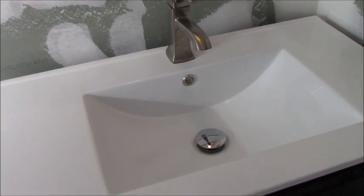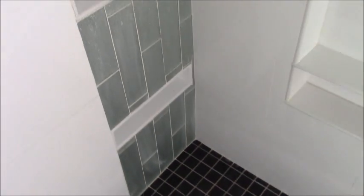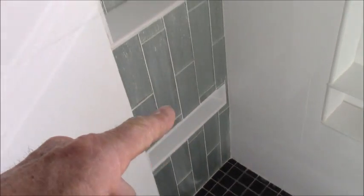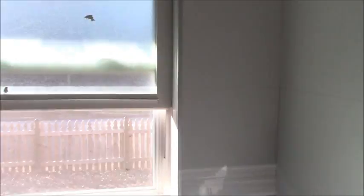This is the new sink — a nice little piece of furniture, and I like it a lot. The customer is handling all the painting and sheetrock work. There will also be a medicine cabinet here eventually. Getting back to the shower, this is a two-by-two tile on a mat. Grout routes got put in and she used prefab niches — they're plastic. There's a small niche at the bottom, a medium-sized one in the middle, and then a large one at the top where she wanted a shelf, so I put in a bullnose shelf so it becomes kind of two niches in one.